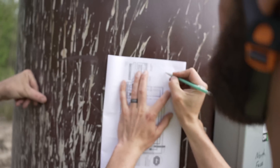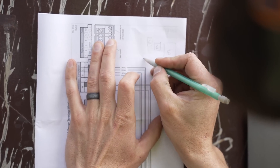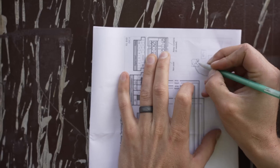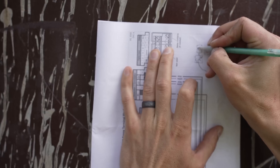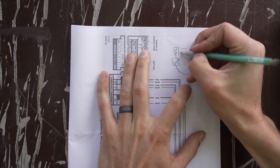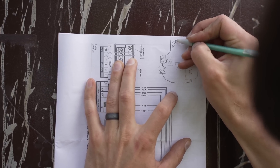We've got the existing disconnects here — I'll call them E for existing. You're going to come out of the bottom with your conduit into a J-Box that's going to house the Enphase Envoy. We'll come out of that into a new disconnect — it's a solar disconnect, but it has AC in it, not DC, because of the micro-inverters. It'll be labeled PV-AC. Then LiquidTite out of the side and north in EMT on the existing strut, with a mini panel 12 inches up.